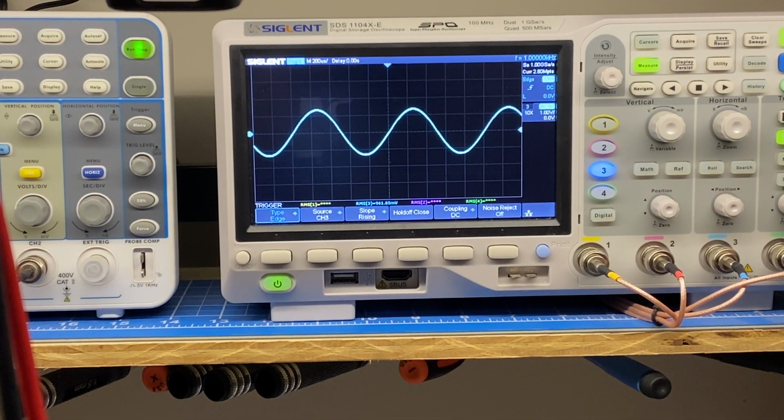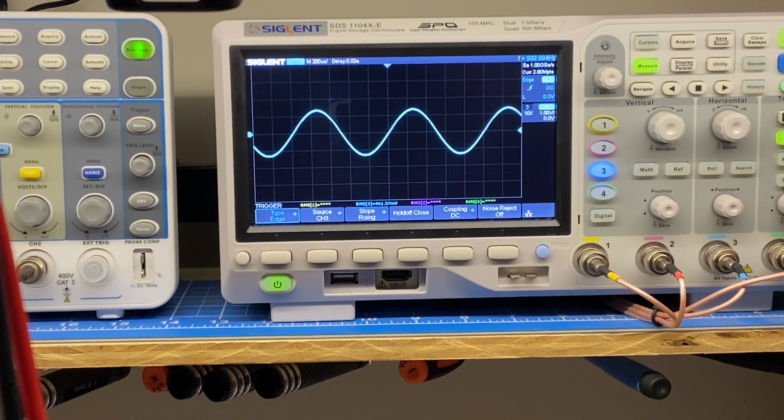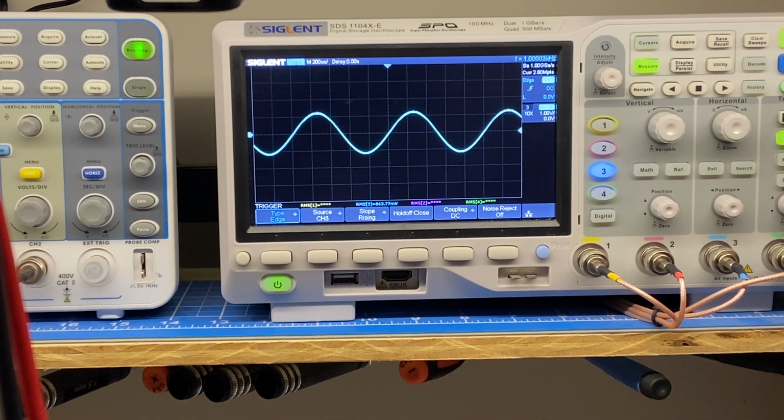This is with the control all the way maxed out, and what I found is if I adjust this down even just 100 ohms, so now we're at 1.7K, I'm at 930, adjust down again, 899, again 863. So I should be able to alter this resistor value and get exactly the level that we're looking for. What I'm going to do first, before I pick a resistor value, is adjust the trimmer to the center of its range.